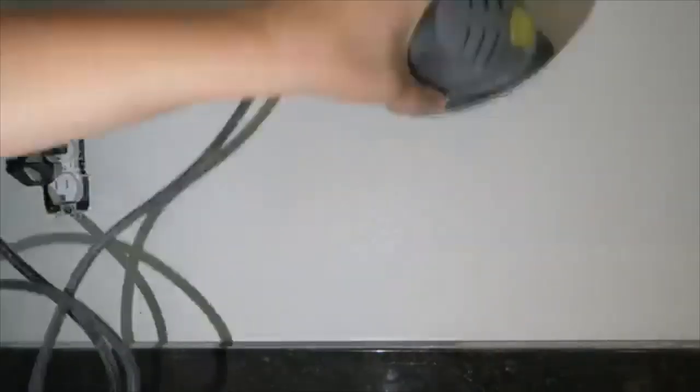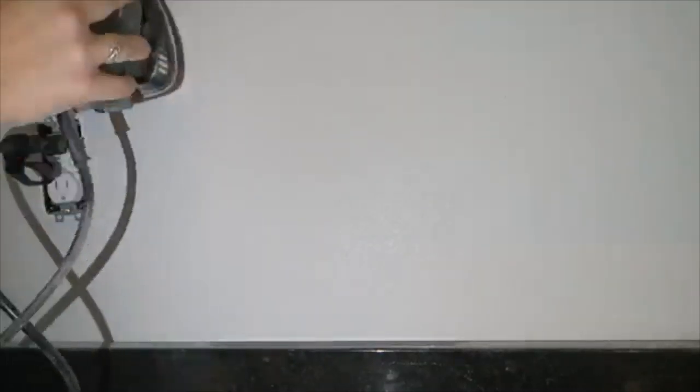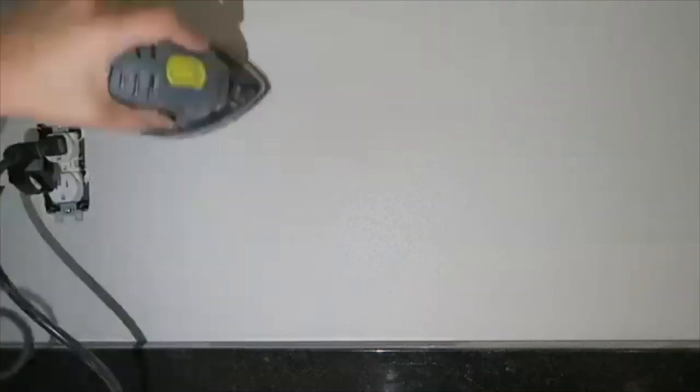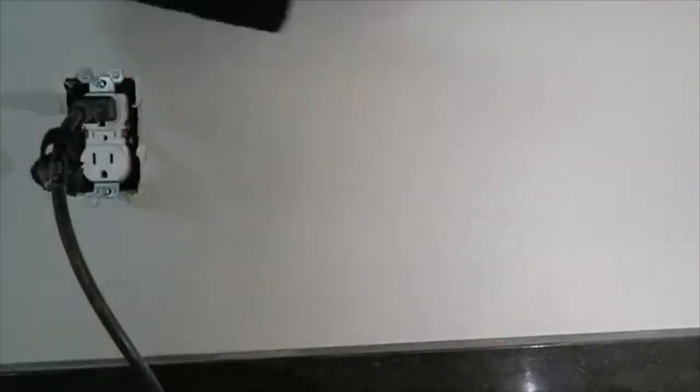I go in with quite a few different materials. My husband had me rough it up with a paint stripper and a sanding disc and another paint stripper and another sanding disc. So long story short, that is what I'm doing here, is I'm just roughing up the walls, giving the mastic and the tile something to cling onto instead of a shiny surface.